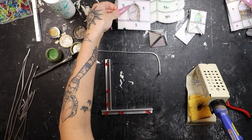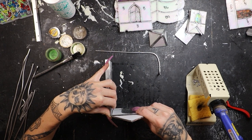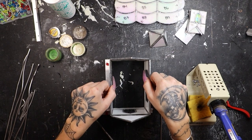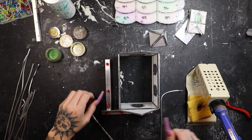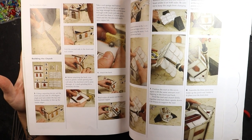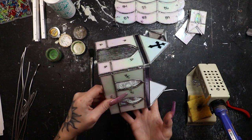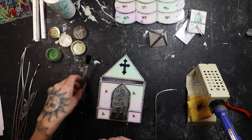We're going to take the front of our house first and grab one of our sides. The side's going to go here, the front's going to go here. We're butting the inside edges up against each other and just going to tack solder those in place. I'm lining up the inside edges just like that. That is the hardest part — we've got our frame stuck together. This thing is starting to look like something. We've put all of our little pieces together. It says bead solder all seams and tin any exposed copper, so it wants us to do that before we put the roof on. We're just going to bead solder all of our edges and then tin any exposed copper. Still being pretty gentle because this thing is just loosely together with those tacks.